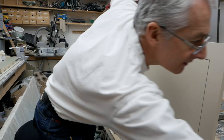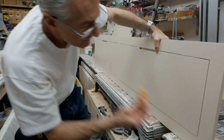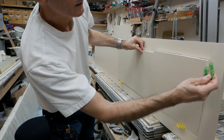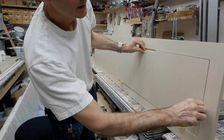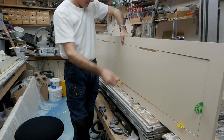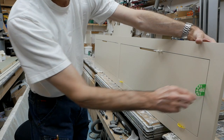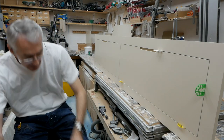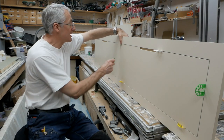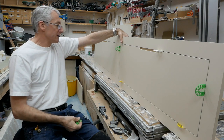And we're going to use some of our little plastic packers just to settle this into the frame. Not quite 2 mil all round, I don't think. About 1.5, or 1/16 of an inch in the old money. There's adjustment on the hinge, so we can do the final tweaking afterwards. And as I say, these are going to have to come out anyway, and they'll be fully fitted when we get on site.